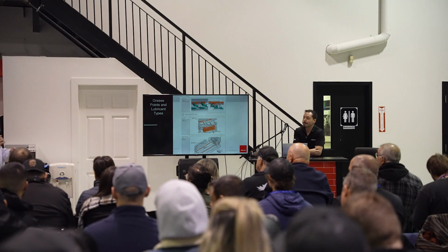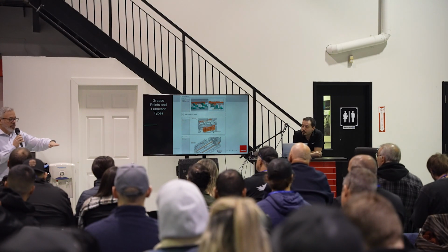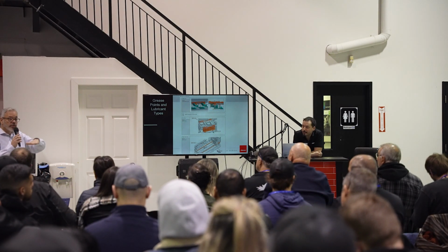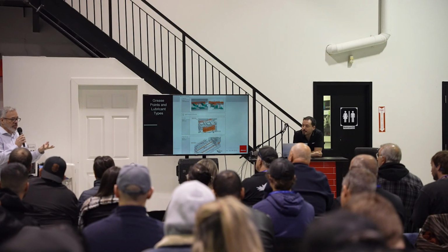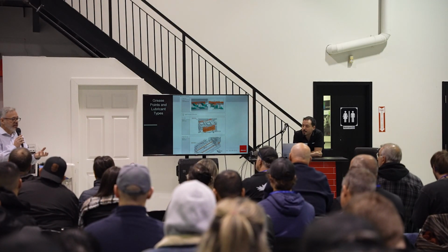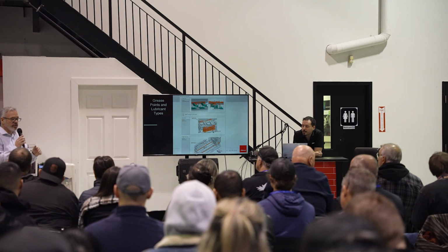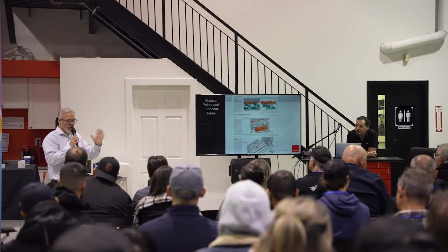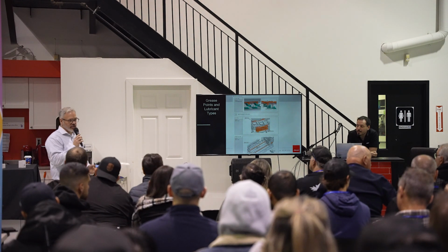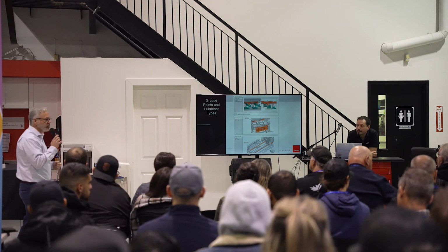Another sign too on eco-solvent machines, you'll notice as you look at the cap top, it's quite flat. The sponge material inside is very, very flat. But as they get old, it loses its ability to absorb, and it starts to stick up. And you'll be able to tell. You'll look at it and know, the same way that you look at the wiper and you see it's kind of curved and no longer flat. That's another telltale sign that it's time to change them out.